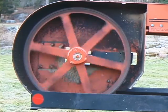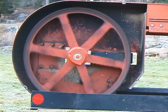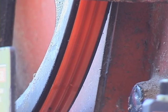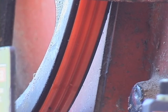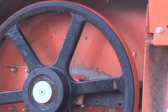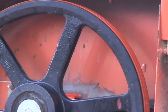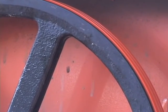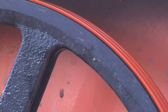It is recommended that you machine steel wheels after every 750 hours of use. If you decide to use our urethane V-belts, you will only have to machine your wheels once to make these belts fit, and never have to machine them again. If you own a mill that drives one band wheel directly from the motor, we can provide you with one V-belt for your idle wheel.